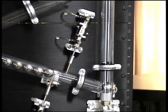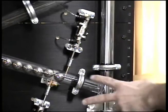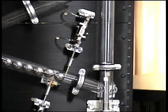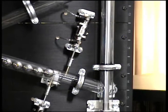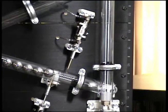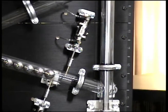So what you're seeing there is, when we get up to the top, we stage the next ball, and then we bring up our stop, and when we get to the bottom, we release it. So it's a double, those cylinders, actually they're very small. I think those are 7/16, maybe they're 9/16 cylinders with a 1-inch stroke.